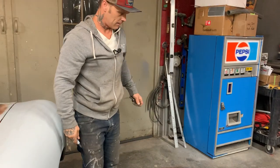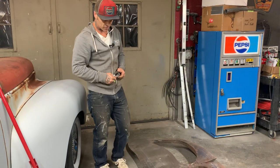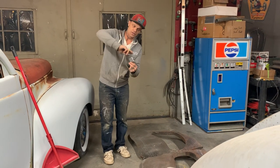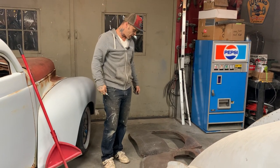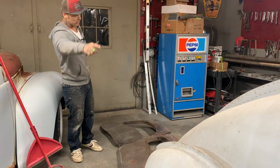That's what I'm doing on the Bugatti — French the hinge and cut it into the door. I'll cut it in, set it in there, then set my hinge on and put my door up. That takes time. That's how I'm going to make it the same, and that's how I know it's going to work on the post — because it's straight.